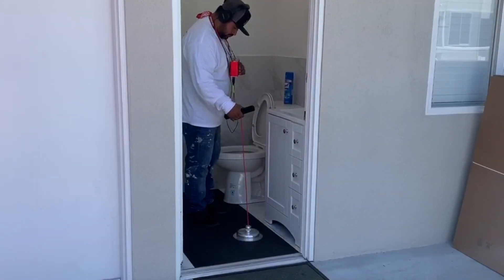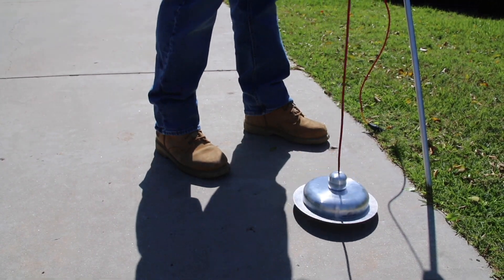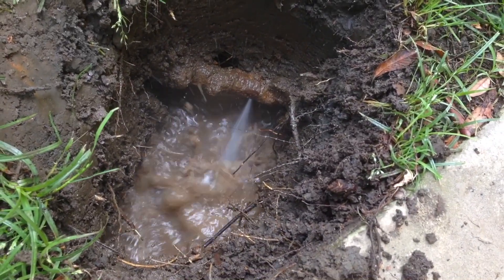Let's try to treat this system and do a leak detection the way the system is. Let's use any existing valves on the property to shut and isolate. Let's close off an irrigation, come back to our meter, watch it. That's not rocket science.